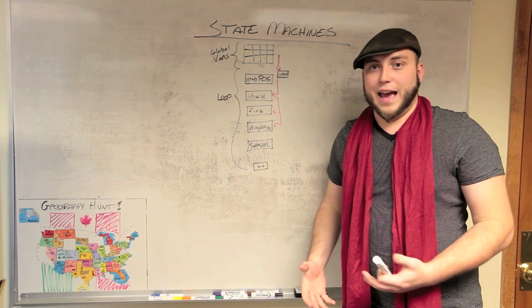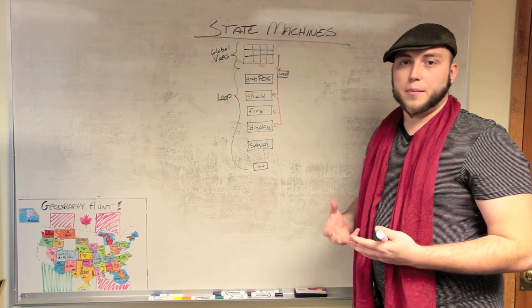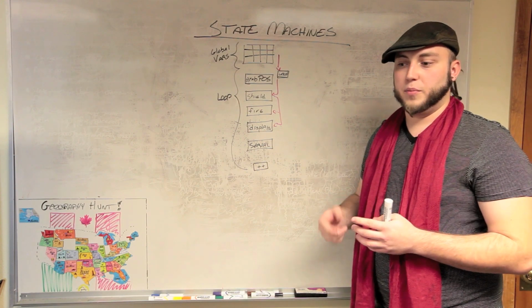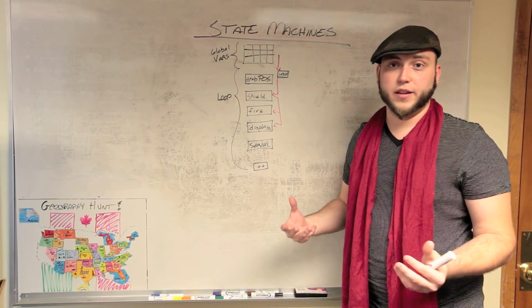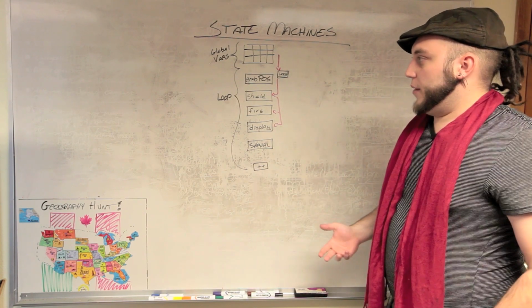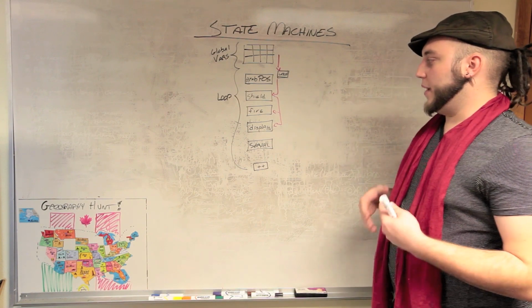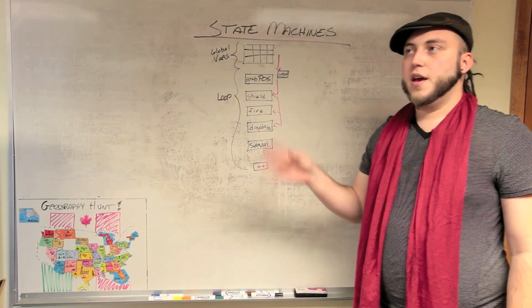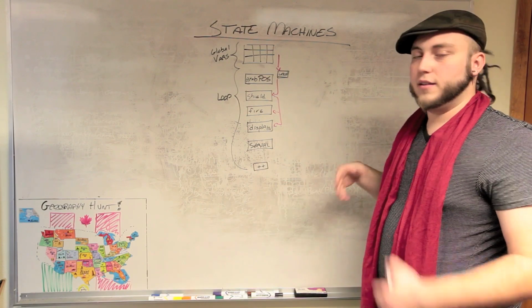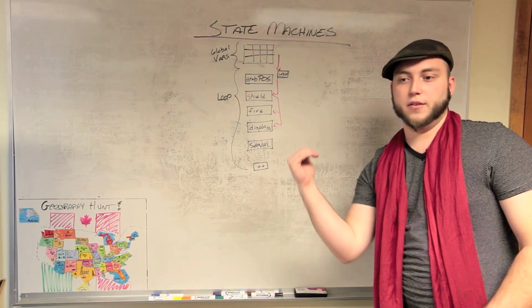The display module is a little bit more complicated because I needed a way to control this multiplexing action that we talked about without holding up the rest of the program. Remember that I mentioned that the multiplex display, you need to cycle through it really quickly. You sort of trick your eyes into thinking all the LEDs are lit at once. That's a hard thing to do in a program like this because the whole program needs to cycle quickly. So the way to do that is to set up a counter in your display module that basically knows every four program cycles, I need to be in this state, or this state, or this state, or this state.